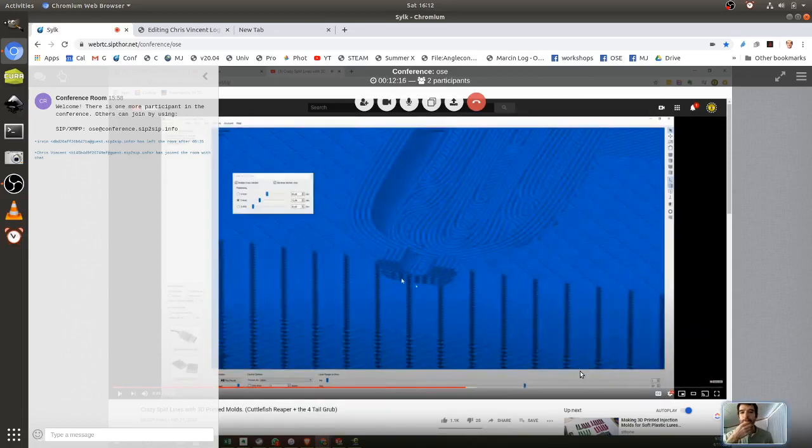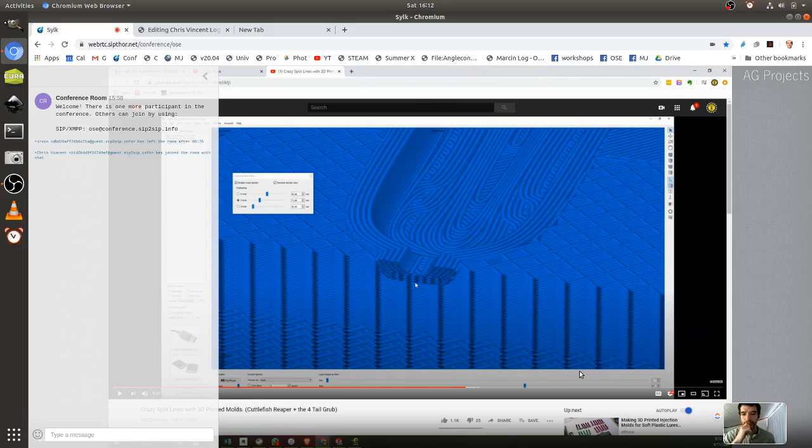Yeah, interesting. So basically, it goes into where he says he needs to. He had like 10 layers and he went to 15 layers, and then that fixed it because there was a spot at the bottom here that got too thin with 3D printing. He's got a 25% infill, I think, on the rest of it.